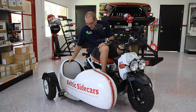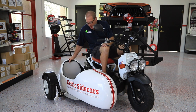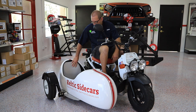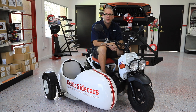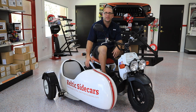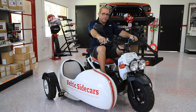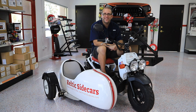Now that you've got all your bolts, nuts, and washers tightened up, you're pretty much ready to ride. Before each ride, take a look at your bolts and nuts, make sure nothing's loosened up, and consider using Loctite. We've gone ahead and slid in our carpet and a folding seat, and put your dog bed in. When you start riding, give yourself an hour or so around the neighborhood at slow speeds to get used to it — it will ride differently with the sidecar on. Something we've done in the past is put salt bags in there; it rides very differently with and without weight. Don't get out on busy streets right away until you're comfortable. Keep both hands on, you will get a little shake sometimes — that's just part of it. Enjoy it, be safe, have fun.